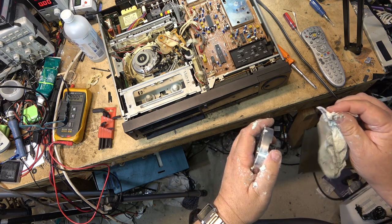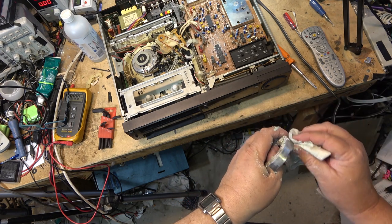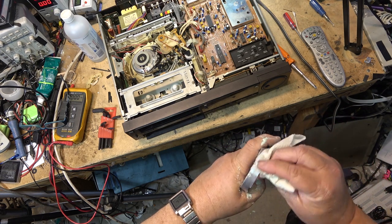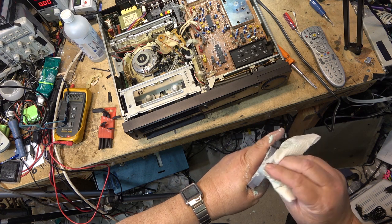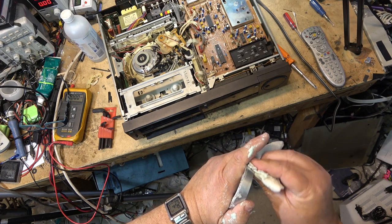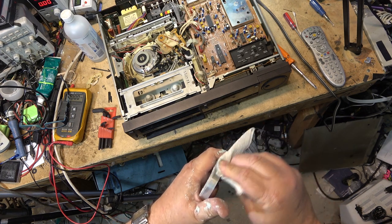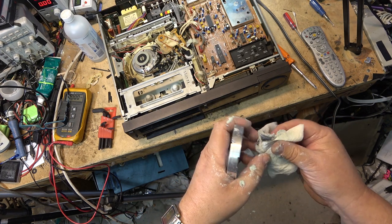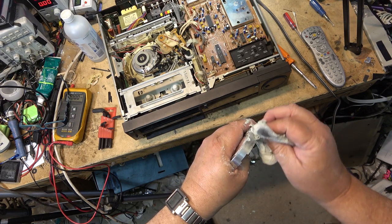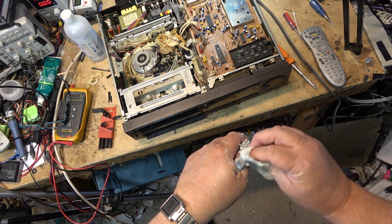If you go back and watch my video that I put up years ago, the Sony SuperBeta training seminar, we talk about this phenomenon, the stiction problem. People would buy this machine and they would buy the expensive tape, the ultra high grade tape, thinking that they were going to get the best possible picture. And what made the ultra high grade tape better than a regular tape was it was a finer grain, and that finer grain could record higher frequencies. The problem with the finer grain was it was also much more smooth, and it caused this problem to accelerate.